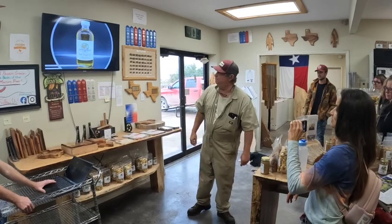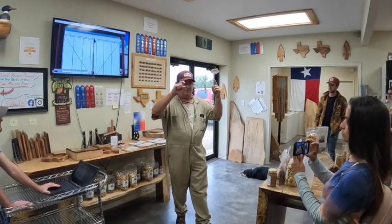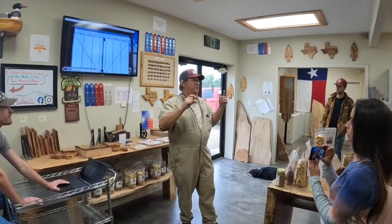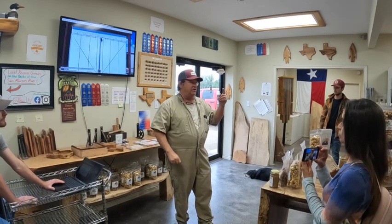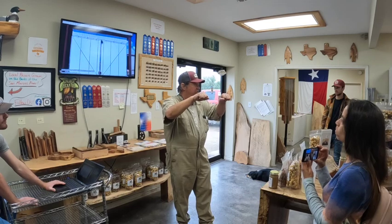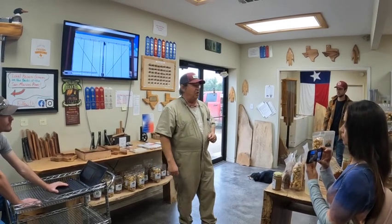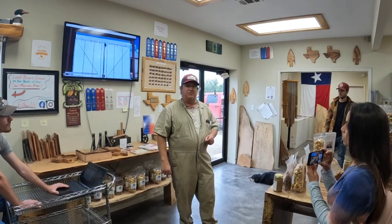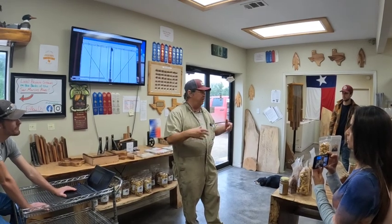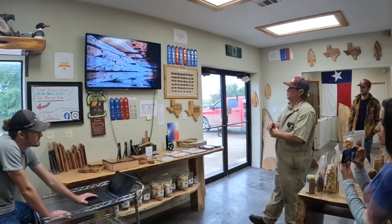Next. It is to be kiln dry. It shrinks it in the thickness the most. You want that done before you build furniture. If you build furniture out of wet wood, it's going to shrink and it's going to change everything. It makes it stiffer, just like a dead branch is stiffer than a green branch. It makes it lighter because it doesn't have the water in it. It kills any bugs and larvae that live in it, and it also makes it where it'll hold a finish. If you put a finish on some woods that are wet, it'll turn white and peel off. So you want your wood kiln dried.